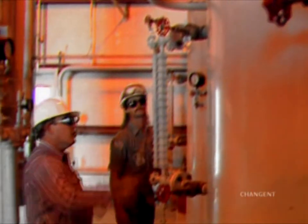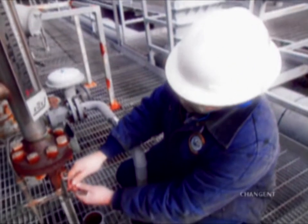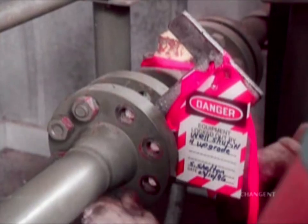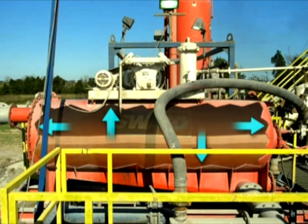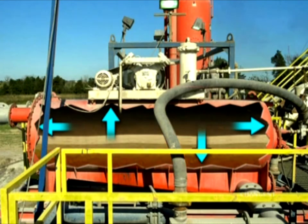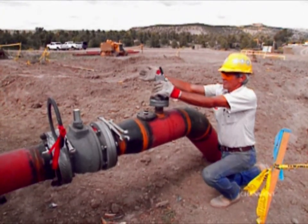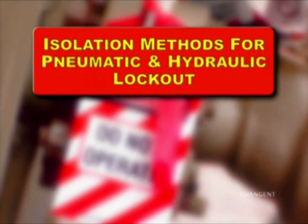Equipment operating with process, pneumatic, chemical, thermal, or hydraulic energy sources require special attention during lockout-tagout because there may be highly pressurized fluid systems in place. These fluids can be safety and fire hazards and must be identified by type and property before work begins. These systems also may have significant amounts of fluid that could be released suddenly as kinetic energy stored in lines, pressure vessels, gas tanks, or similar storage units. In addition to standard lockout-tagout procedures, specific isolation methods are therefore necessary when preparing such equipment for repair or maintenance.